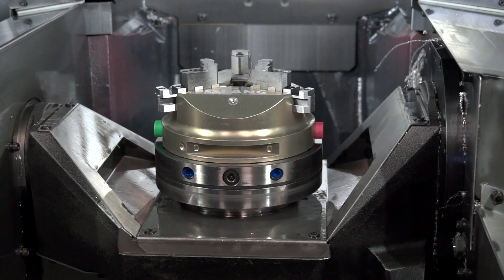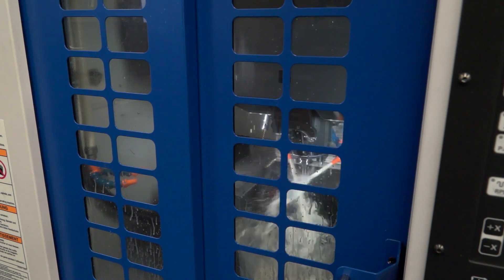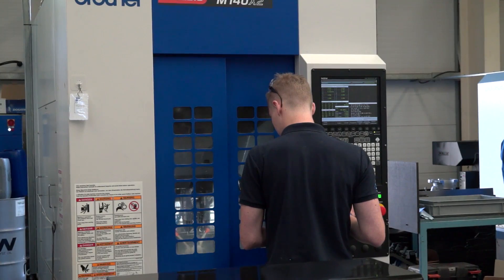You go from job to job quite frequently as well. I believe you're using Lang quick-change chucks for that? Yes, we put pull studs on the back of our chucks, vices, fixturing, even our billets — so everything goes on and off quickly. We prove one job during the day and run a night shift, so once parts go into inspection we get a second job up and running. We don't lose time while parts haven't cleared inspection — we drop onto another job and keep the machines going.